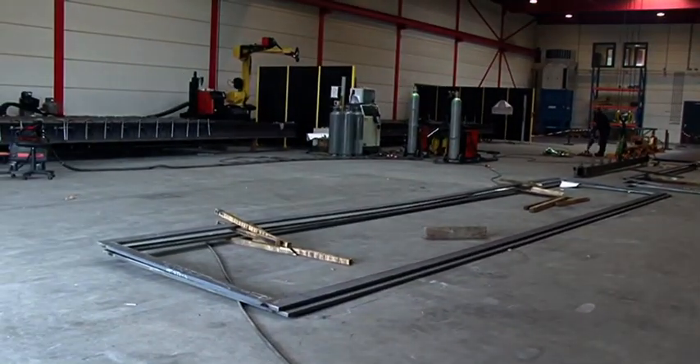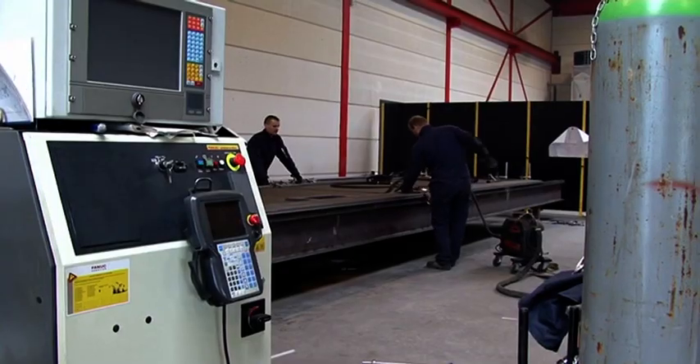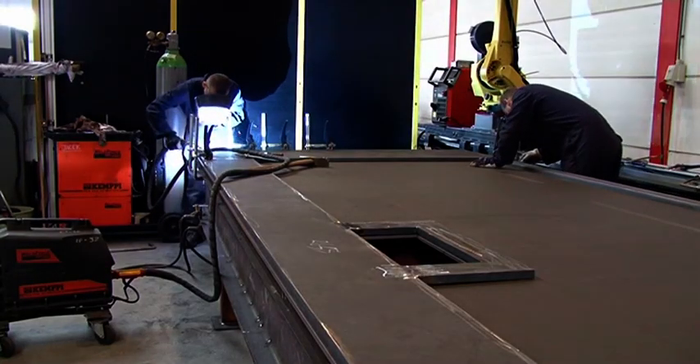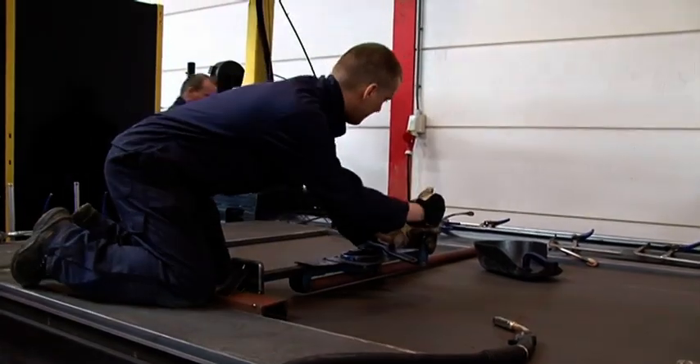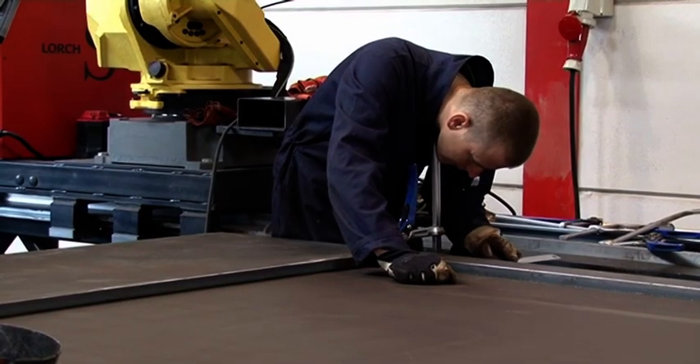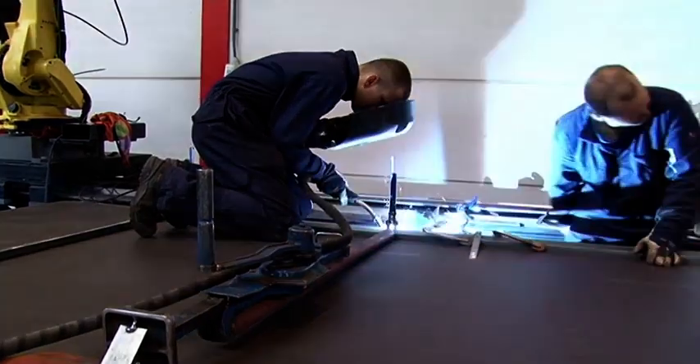For Dawson Bridge, the faceplates are 10mm thick and the elastomer core is 25mm. The faceplates are blasted to create the bonding surface and cut to the final size and shape. Edge bars 25mm thick are welded into a frame which is fixed to the bottom plate.